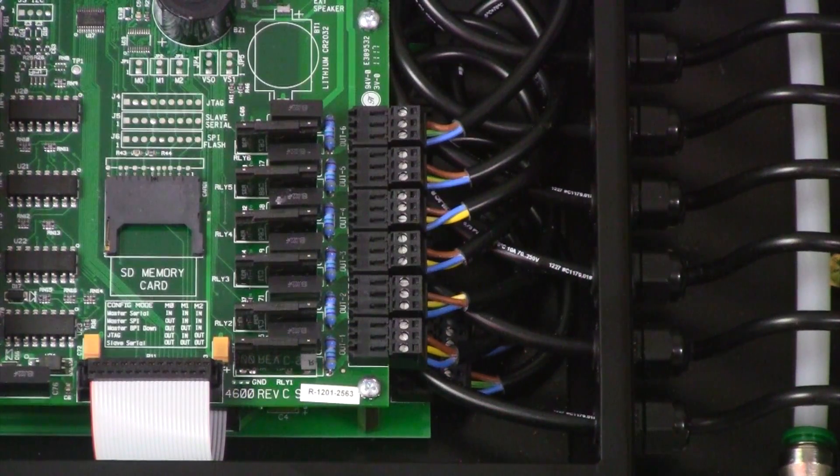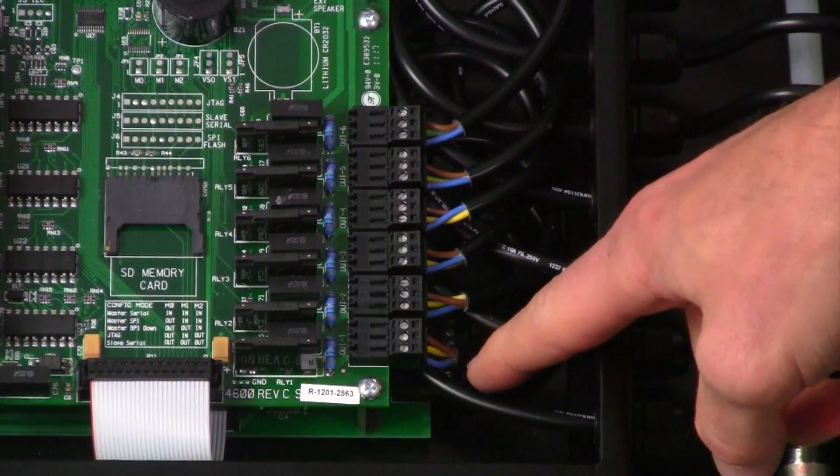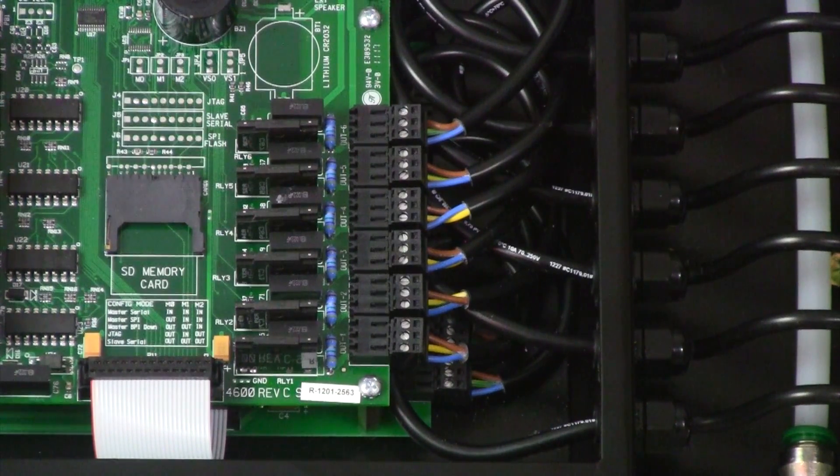The outputs for an SPR2000 system are located on the right hand side of the circuit board. There are six connectors on the main board and eight more connectors on the lower expansion board. It's important that the supply voltage and the solenoid valve voltage match each other — if your supply voltage is 110 volts AC you need 110 volt solenoid valves, and if you're using 240 volt supply power you need 240 volt solenoid valves. The maximum power for each output is 10 watts. The outputs are all pre-wired at the factory, so all the valves are wired into the outputs on the board and do not need to be connected in the field.